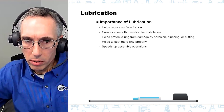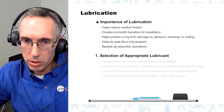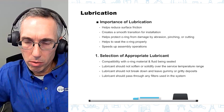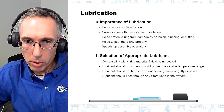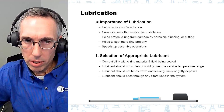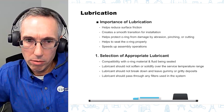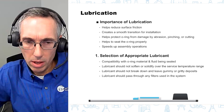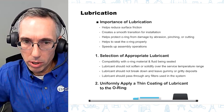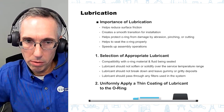When selecting the lubricant, it's important to consider multiple things to get the correct lubricant specified. Obviously you want to make sure it's compatible with the o-ring material that's been chosen, and it also needs to be compatible with the overall system fluid being used. The lubricant should not change significantly over the service temperature range you're expecting, so its properties don't degrade and it doesn't break down and create contamination flowing throughout your system. You should also consider that it should pass through the system filters. When applying the lubricant, apply a thin, even coating to the o-ring.